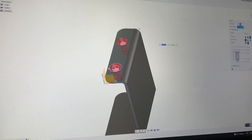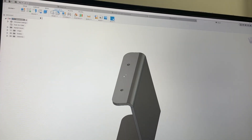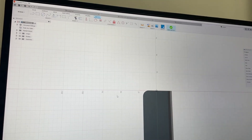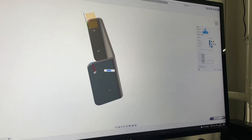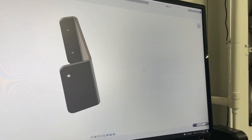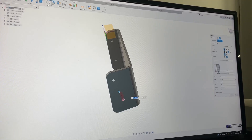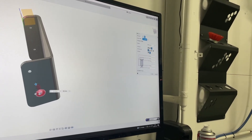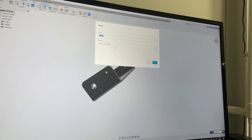Let's make a tiny hole — 3 millimeters — so that's gonna take a small tool. Let's put two more holes here. Let's take that one and make it an M5 threaded hole. And one last hole: a countersunk straight hole, 6.5mm for M6. That's gonna be great.